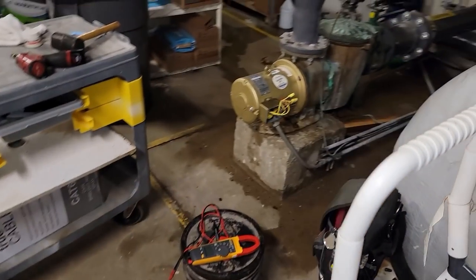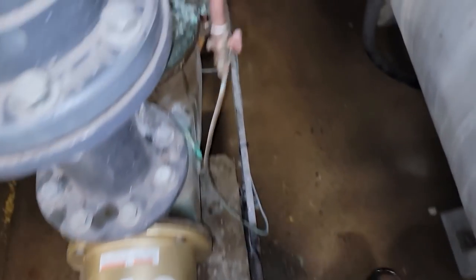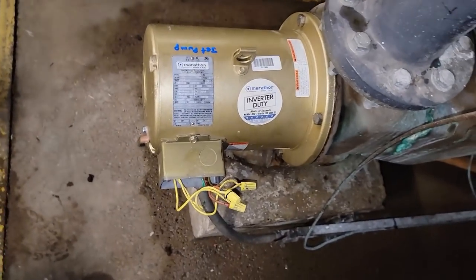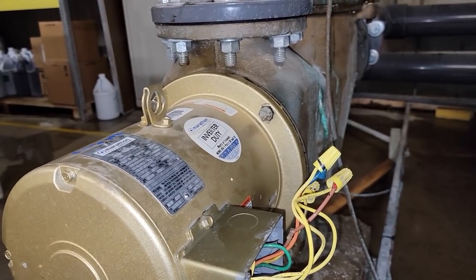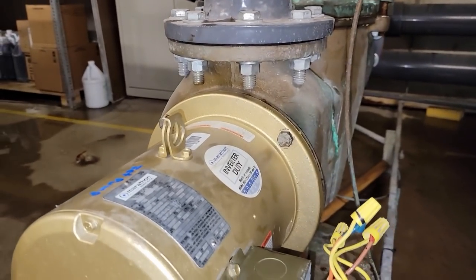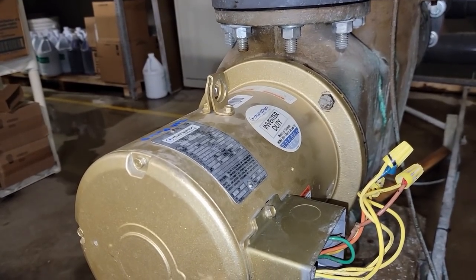I'm going to wrap up the video here. I'm going to shut the power down and put those wires back in there — that is 480 volts. You could have a nick in a wire you don't see and get arc flash, so we're working on it dead. Get these taped up, put back in the box. We don't have any leaks up there, we don't have any leaks down here — we've got it. Appreciate you watching. It's not my usual HVAC videos but it is plumbing-related so it kind of is. Check out Instagram and Facebook, give it a thumbs up, and we'll catch you on the next one.